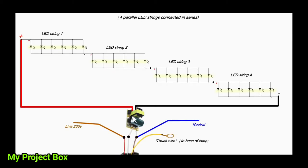This is a current limited power supply, so it will adjust. It'll try to only maximally output about 200 or 300 milliamps, but I want to divide all this current nicely amongst these LEDs. Serial parallel pairs is probably a good idea.